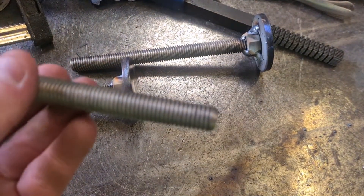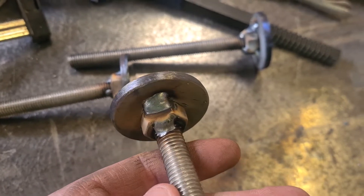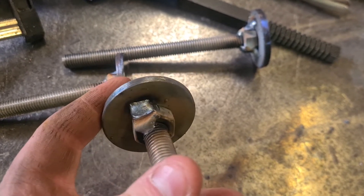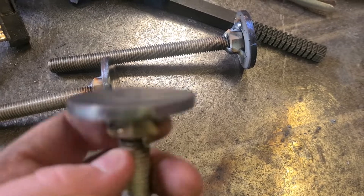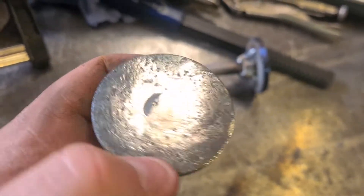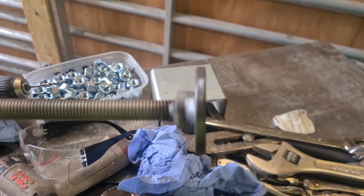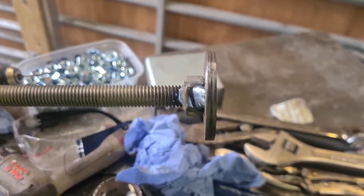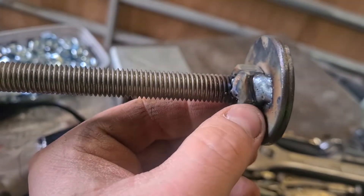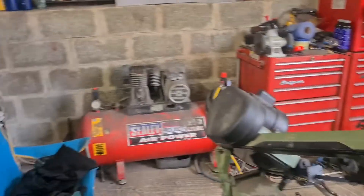This is what I've done — I've just cleaned up the threads at the end so I can get them in. I've welded on two of the flats to the actual feet and then the same on the threads as well, so that one can still get a spanner on there and adjust it to where I need. I've just buzzed in the hole that I had in the bottom and then ground it back so it's nice and flat. I'm actually relatively impressed because it's quite fairly straight. All I did was just hold them in place — they don't have to be straight, they've just got to do the job. You can see I've done that one just welding around it. Now, time to get them fitted to the bench and then get the bench in position.